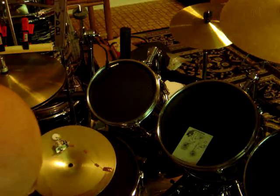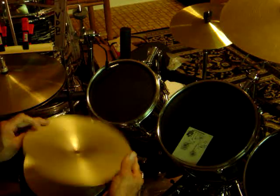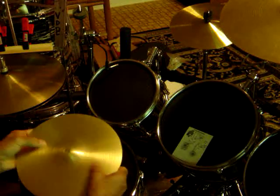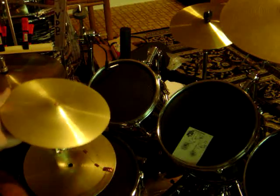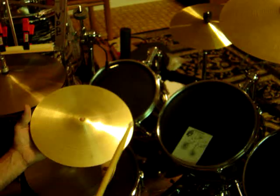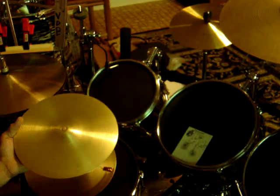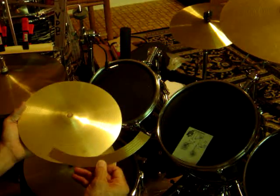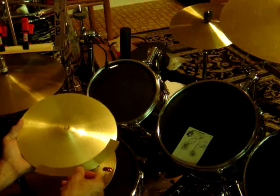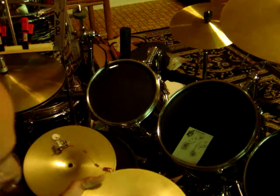The cymbal I'm using as a base cymbal is from a child's Pulse drum kit. This is a little more solid of a cymbal than the one I'm using for the switch, so this one is pretty sturdy. It has pretty much terrible acoustics, but it works great as the base for my electronic cymbal. So what I'm going to do is take this cymbal and use it on the underside as a contact switch — touch these two together and make a switch. Also I'll mount a trigger here.